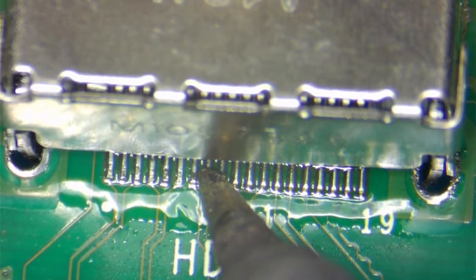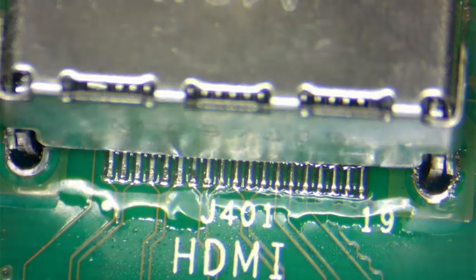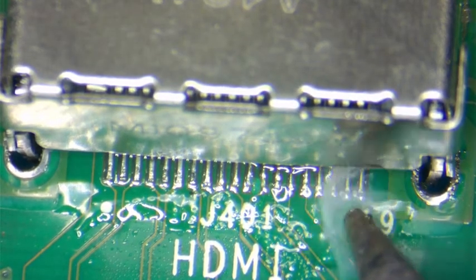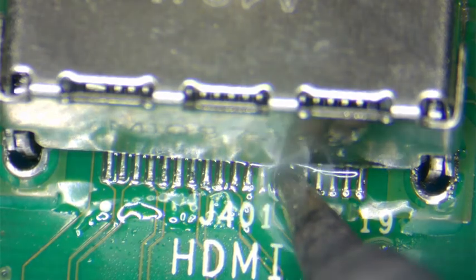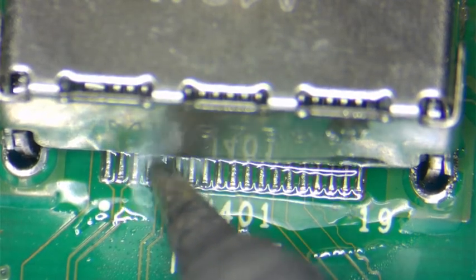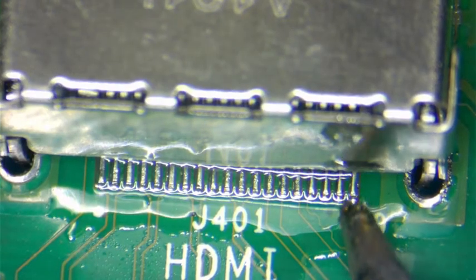So all I'm doing is just going over the pins so that the HDMI port stays in place. So I'm going to turn it over and solder the main four sides on the other side. The tools I use will be in the description.